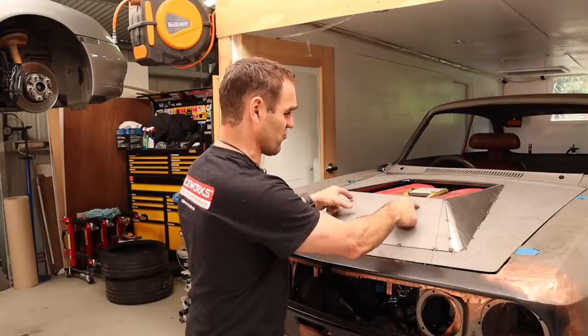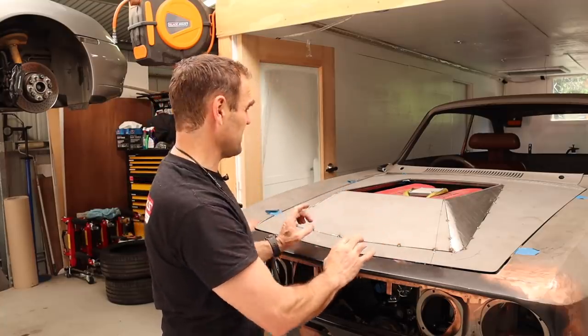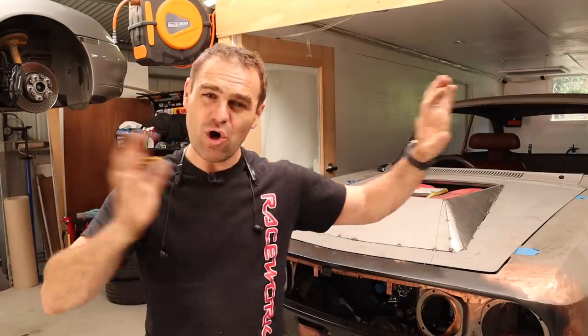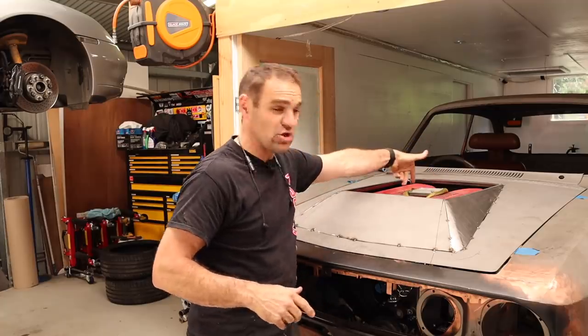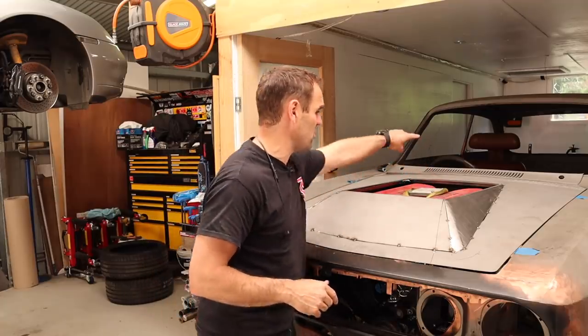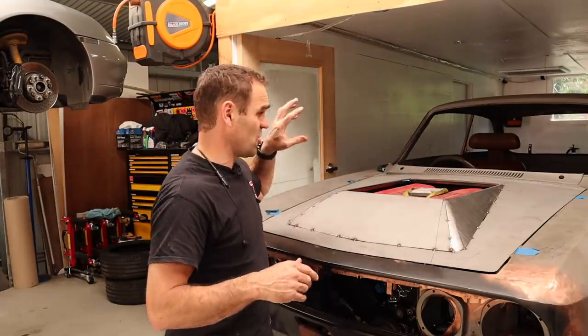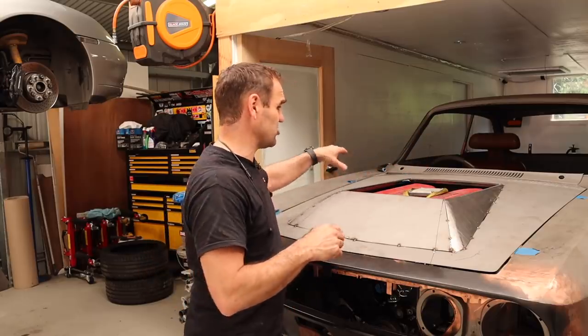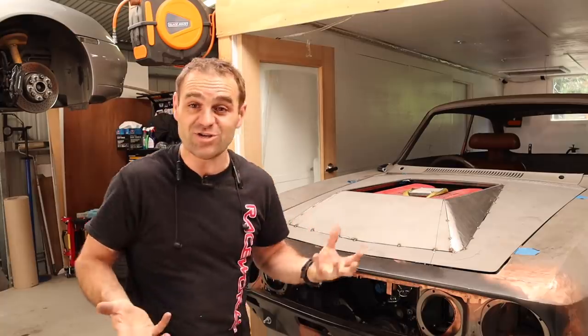And there is no way to fit throttle bodies on the front here and then air filters and stuff. The air filters will be out here. I covered this a long time ago, with the plenum. I actually already turned this around 180 degrees. Lots of people think I should put it back the other way. The thing is, by the time I turn this around and then have throttle bodies on it, it's going straight through the plenum into the dash. There's no way to have the center of the dash. It won't work, and I'd have to remove all the windscreen wiper movements. This is going to be a road car. If it was a race car, no problems, but this is a road car and it has to function like a road car.